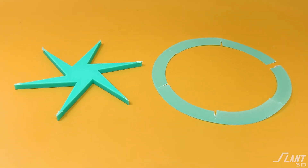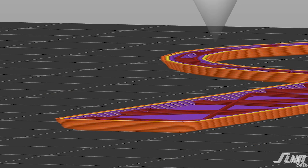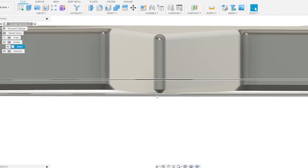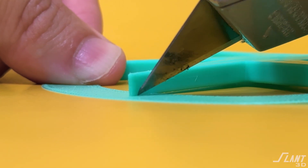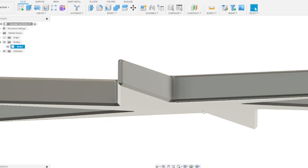Those are the two simplest ways of creating a brim. But one subtle thing — a brim adds material to the first layer of your part, which means that area can potentially be wider. If you want to make sure a brim doesn't leave an artifact on your part regardless of how good the post-processing is, you can design the part correctly for 3D printing. In every video we talk about applying a chamfer to the bottom of your part — this is even more important when you are using a brim. We applied a 0.2 millimeter brim and also a 0.5 millimeter chamfer. This has the point of contact of the brim slightly in from the outside of the part, and that chamfer also serves as a guide area for the blade that is trimming off the brim. This makes sure the brim doesn't add more material to the part, and if it does, it's not noticeable.